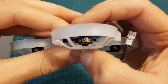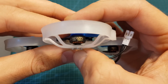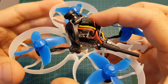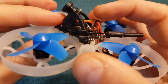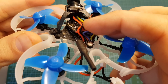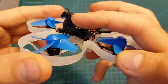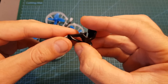Unlike the Beta 75X which uses 1103 motors, the Pro 2 uses 0802 12000kV motors. Under the canopy you can find a customized version of the BetaFPV Z02 all-in-one camera. The camera features a CMOS sensor, its picture format is NTSC, and it is connected to a VTX which supports 48 channels, features smart audio using TBS Smart Audio protocol, and its output range is 25mW. The camera is fixed to the quadcopter using a 35-degree mount, but a 25-degree mount is included as well.